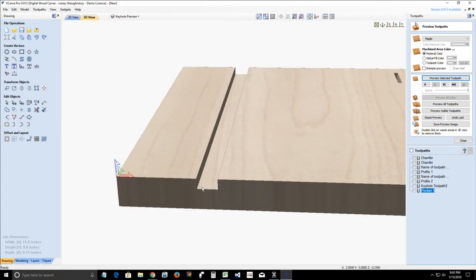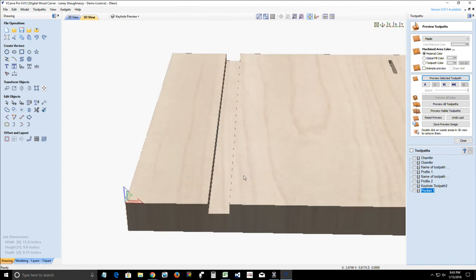Okay, so you're saying that when you cut your dado, Peter, you got a quarter inch depth of cut, but your half inch dado ended up being a 16th of an inch shy. It did not cut a half inch wide. So if we look at my X position of 1.899 to my X position of 2.399, from left to right, that was 7/16 for you, not 1/2 of an inch. Is that correct?